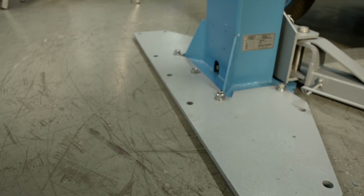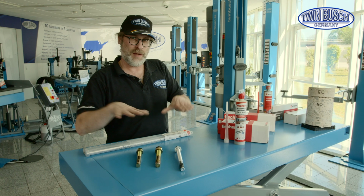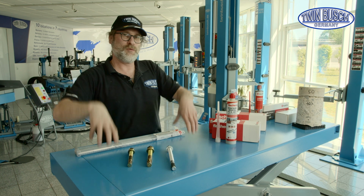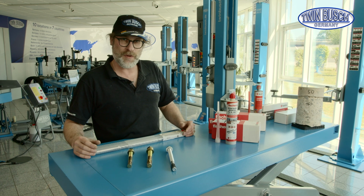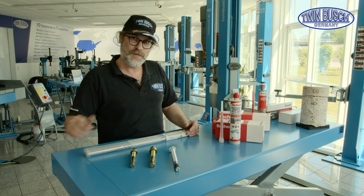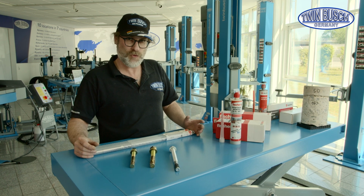You can also mount them afterwards on top of the actual post base. These are built in such a way that they distribute the load which is taken by the post base, but they also press the post base downwards. They are not mounted under the base, they are rather bolted on top of the post base. Plus, in addition to the lift's actual anchor system, another 9 heavy-duty anchor bolts per post, so we're on the safe side.